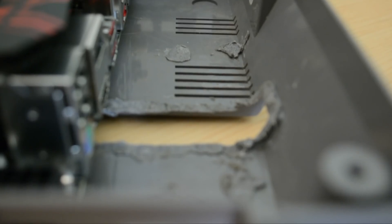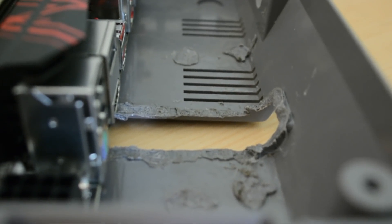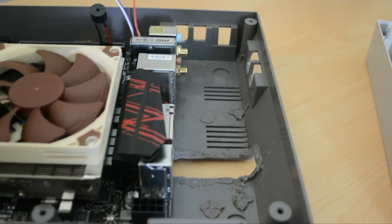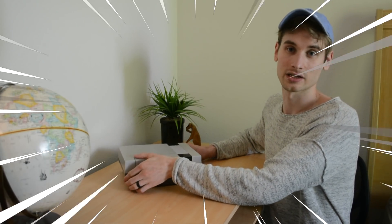Thankfully, who do you know who's actually going to come to your house and pick up your retro game console to make sure that it's authentic? And it's not all bad — from a functionality standpoint, there's actually a little bit of a give and take. The extra gap on the bottom actually allows better airflow to help cool a lot of the components inside, which is a notorious issue among NES PC builds. But I won't lie to you, removing this much of the base leaves the overall structure a lot weaker. If I pick it up, I can just feel it flexing underneath its own weight.